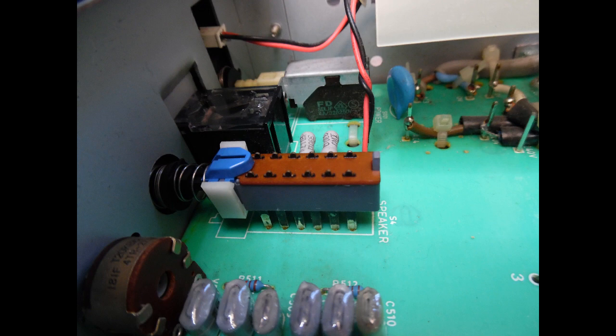I used an audio test signal — a 1kHz sine wave coming in at approximately 150 millivolts. Using the scope to check the signal, altering the volume, there was absolutely nothing when the switch was operated. But on the common connection, you could see a good sine wave, confirming the signal was present.